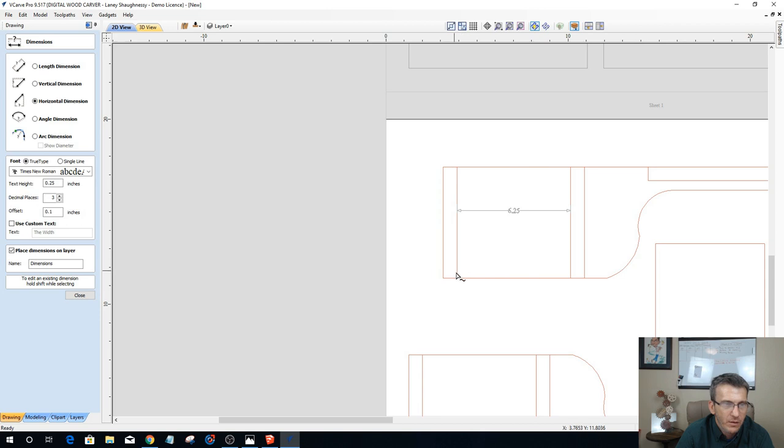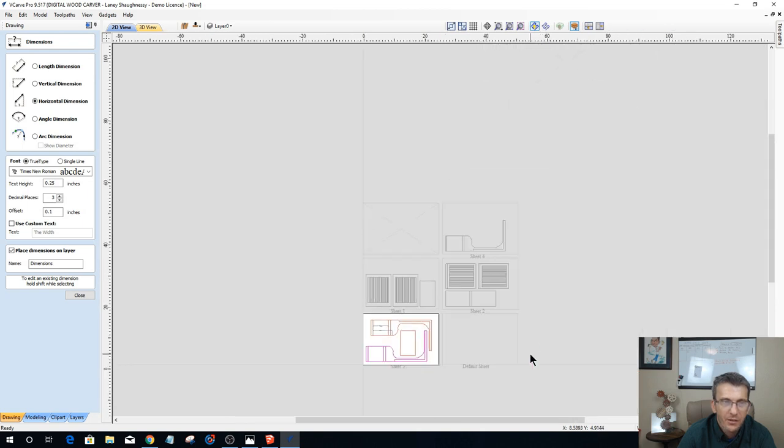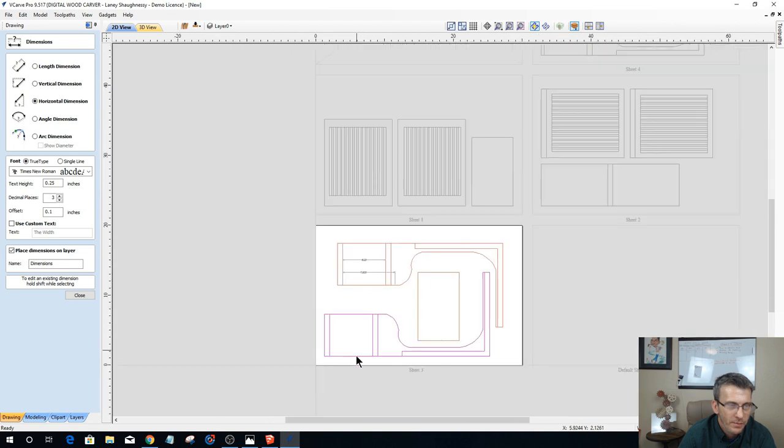If I lowered that shelf down, and let's say that I measure from the inside of here to right about here, I've got 7 inches, and I don't need 7 inches. So adding a second shelf, not a bad idea. That means it's gonna be in the center. If I add a second shelf, I'm basically gonna need two more of these parts right here, okay? And then I need to change all three of my pieces. All three of my pieces, I need to change the position of this dado, lower it down, and add another dado where I want that middle shelf to be.